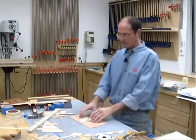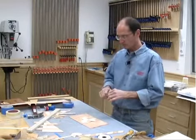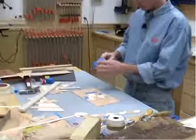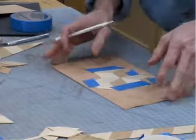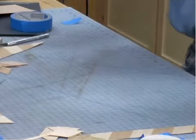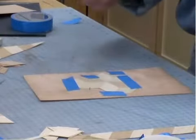I don't want to do an inlay technique where I cut a cavity and put this into a piece. But by setting it on top of this piece of veneer, I have access to both sides of my veneer when I go to knife it, so my inlaying technique will be much easier. I'll just tape it right down however I want it to go. I'm going to put my knife right up against the edge and follow all the way around to cut this shape out of the piece underneath. This piece on top will fall right in, and I'll have one piece of veneer. Since it has many different ways it could fit in after I cut it, I need to mark between the two so I get it back in the same way.